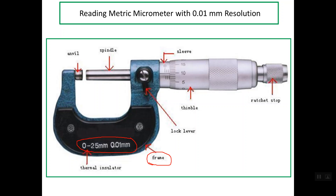The range of this micrometer is simply between 0 and 25 mm, and the resolution of this micrometer is 0.01 millimeter. At the front of the frame we have the anvil and we have two cylinders. The outer one is called the thimble and the other one is called the sleeve. On the sleeve we have a graduation which reads the whole millimeter and half millimeter, and on the thimble we have another graduation which contains 50 equally spaced lines.